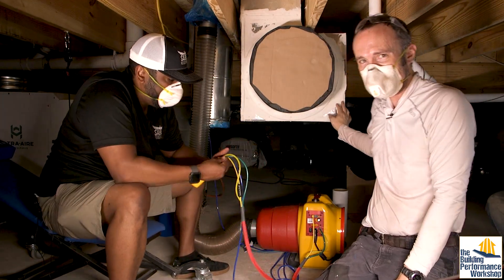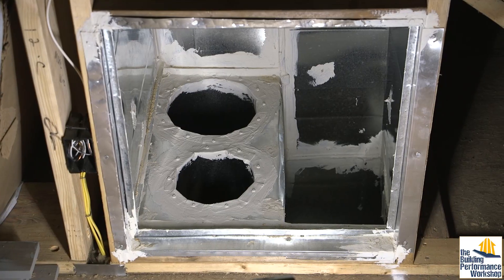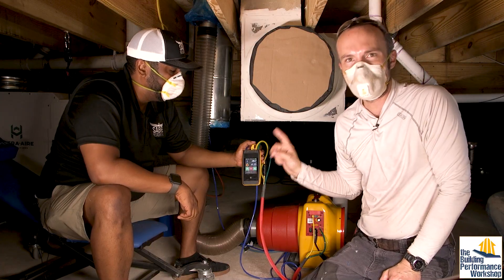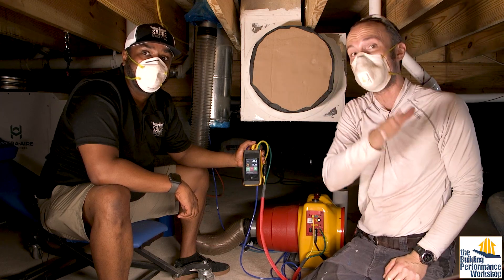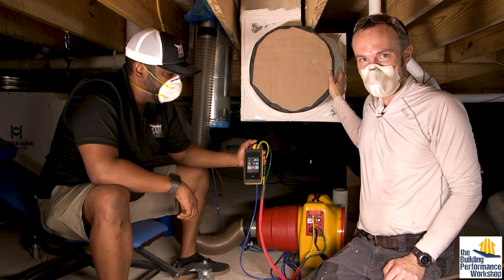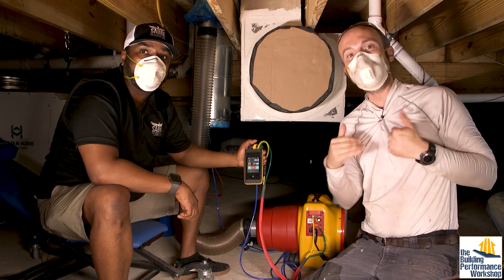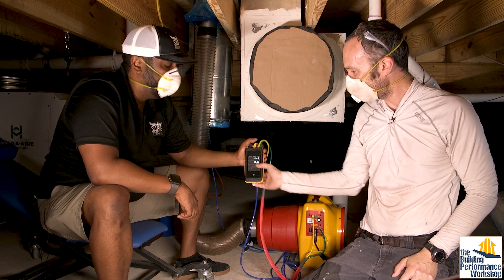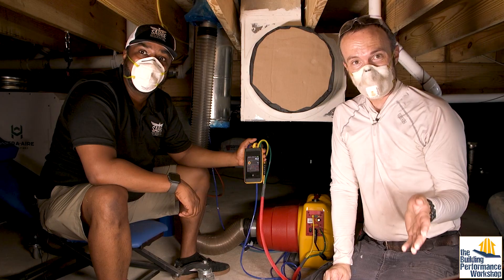This box is pretty complicated. Is the box sexy? It's a good looking box, so I get points for style. But I'm probably going to come along and try to find any other leaks and seal those up too, because I'd rather keep it way below that 88 — 88 means I'm going to fail. So for such a small portion of the ductwork, I'm not really happy with that. I've learned that as a trainee, I need more practice before I'm set free on my own. And that's a useful thing to learn from your equipment. Thank you for testing me. Make sure you comment, like, subscribe, and tune in next time.